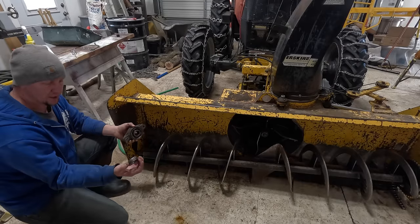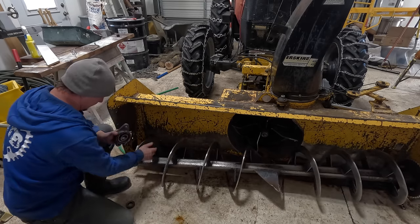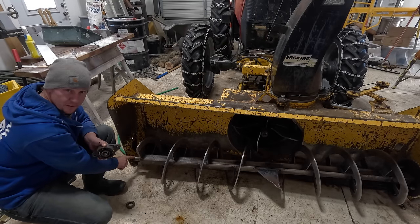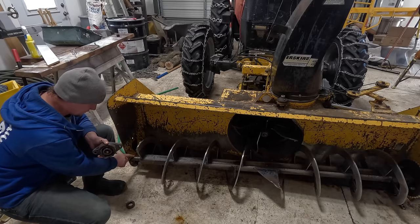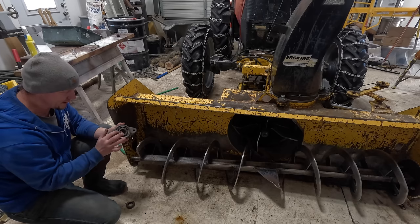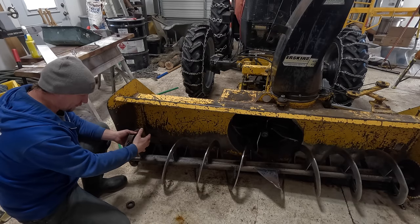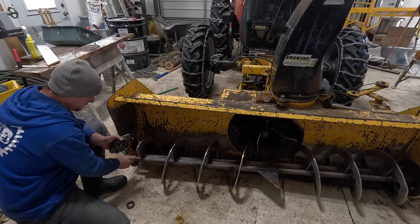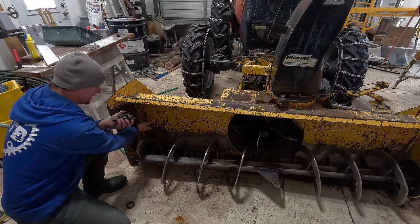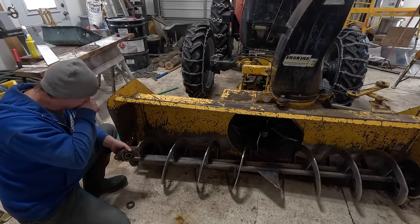And there's a little lock collar that's supposed to be on there. But I can see right here where that lock collar slid from the set screw, and that rotation is enough to release the lock collar from the bearing. So there was force on here from the barbed wire that was wrapped up in there so tight, forcing the bearing apart. So to get home, I just lifted the auger on top of the bearing, raised the thing, and drove it home.